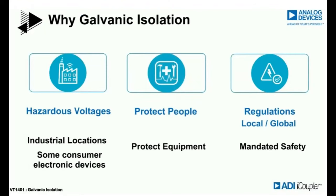So when do you need isolation? There are basically three usage cases. First: hazardous voltages or noise, so industrial or robotic usage, where there's a lot of high voltages or electrical noise, and you want to isolate your motor power supply and ground totally from your sensor power supply and ground. You might want galvanic isolation.